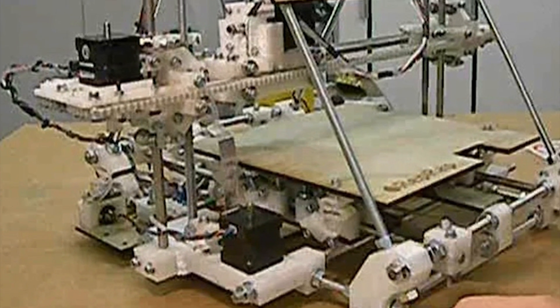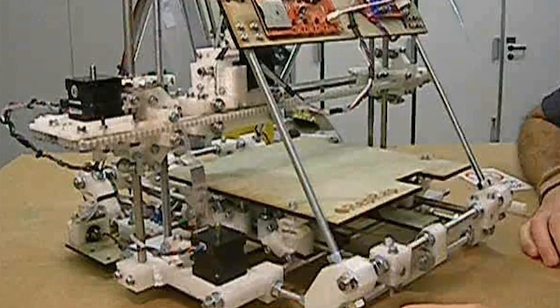It described an ambitious, low cost, open source design that became widespread in the early maker community. The chassis precision was achieved by using threaded rod and stepper motors used in three axes to precisely control the position of a heated printer head that accurately extruded a plastic filament onto a hot plate. In a wonderfully reflexive demonstration of the technology, the first item ever printed on a new printer would be the components necessary to build yet another copy of the printer itself.